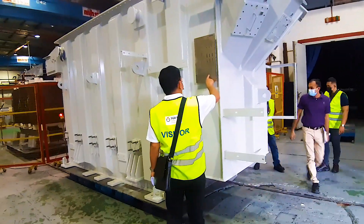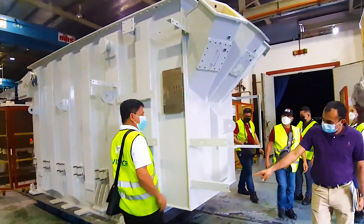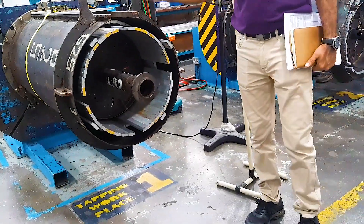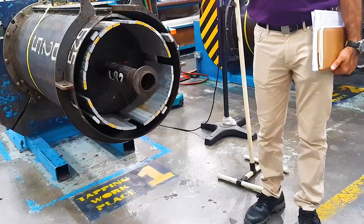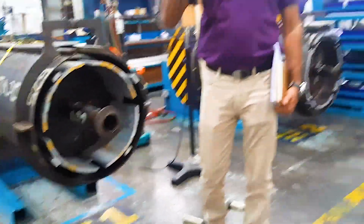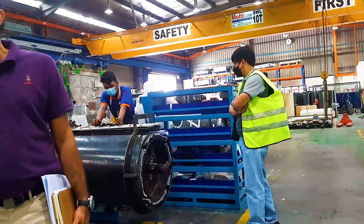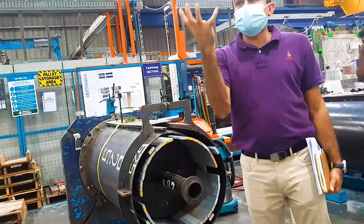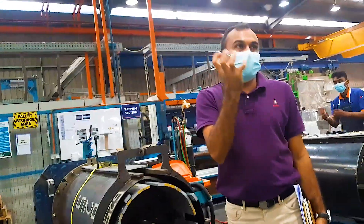Inside this gap, once the liquid is ready, it is filled in. It is under vacuum again — no air to be packed. And then it goes into the oven. We have the edge of the oven where it will be heated for almost 30 hours at 160 degrees to make the resin harder. Then it will be hardened and solidified.